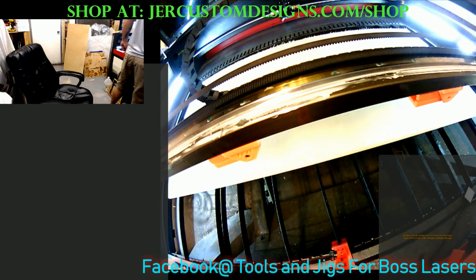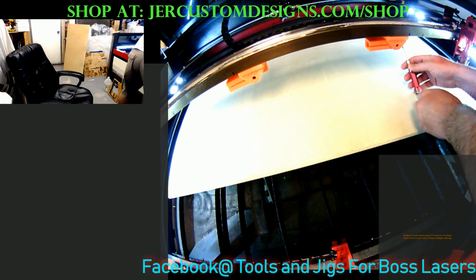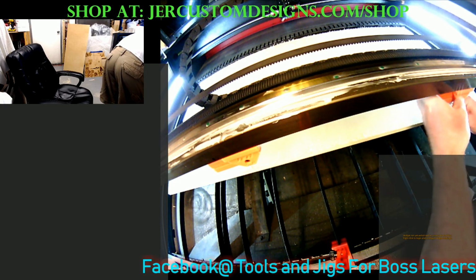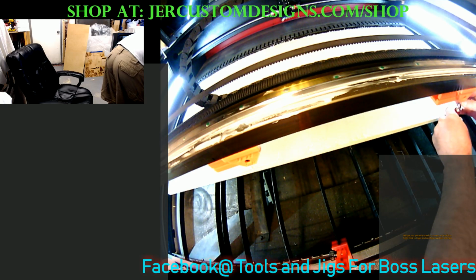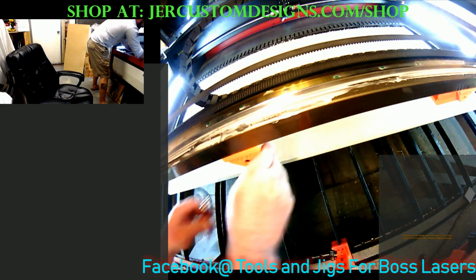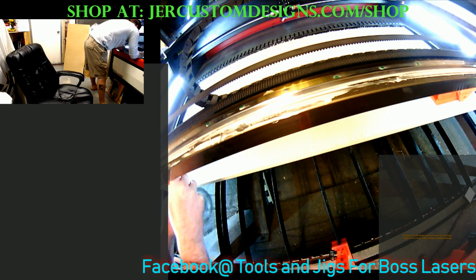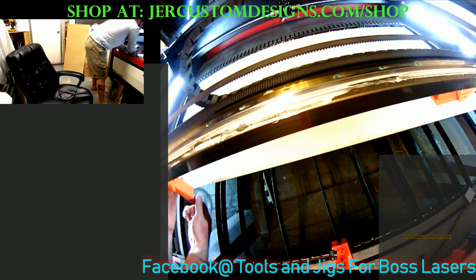What I have here is the gantry alignment jig that I got. You can find it at the link up here. What I'll do with that is position it for doing large items, and I have it pre-marked on my gantry with Sharpie. I have a mark for large items, and I also have one for small items slash rotary, to align the rotary to the gantry. Just simple adjustment. One Allen head screw, I think it's a 2.5 if I'm not mistaken. No, 3.5. Stick it up in there, tighten it down.